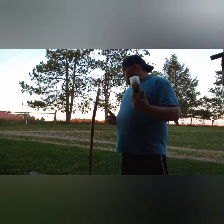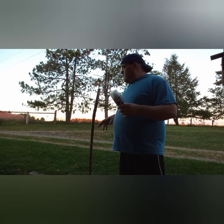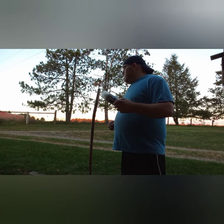So, that's that on that. You've got to let this dry. Usually it only takes maybe 10 to 15 minutes to dry. And then, like I said, I'll do a light rough, low grit sanding on it, and it just makes for a better, smoother surface. Generally speaking, I usually do two coats of this, but sometimes I need only one. It depends on how much it absorbs.